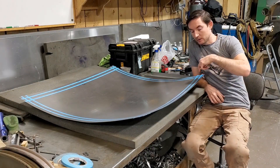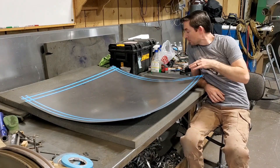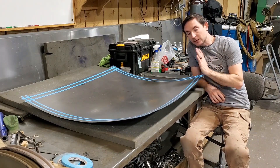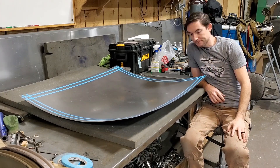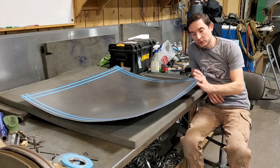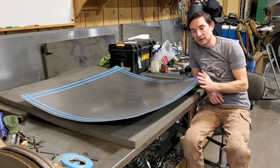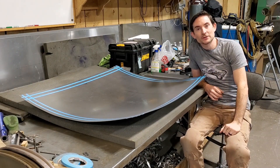So now I've gone and made all my marks all the way around and laid everything out with tape — that way it makes sure it's a nice clean line with no waves or variation. Now we're ready to trim all the excess off right down to that tape line, make sure it's nice and filed smooth and deburred, and we're ready to turn the flange in the flanger.